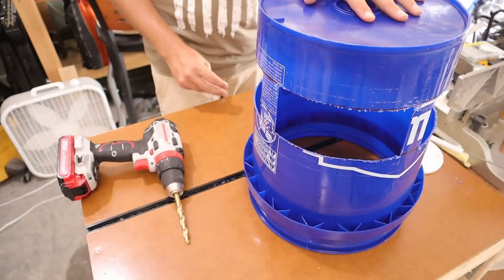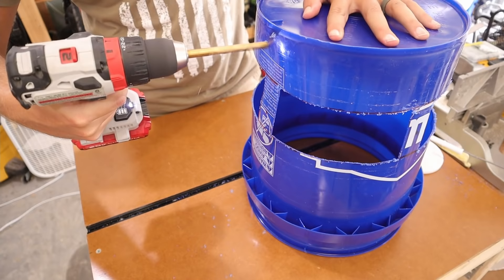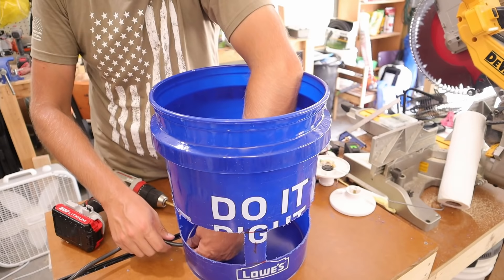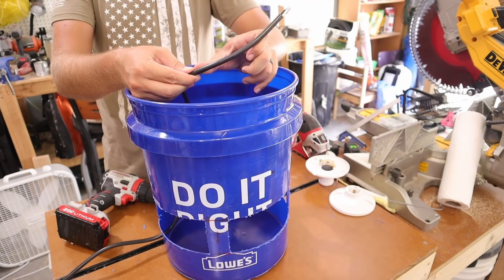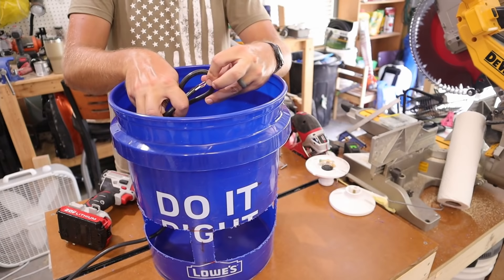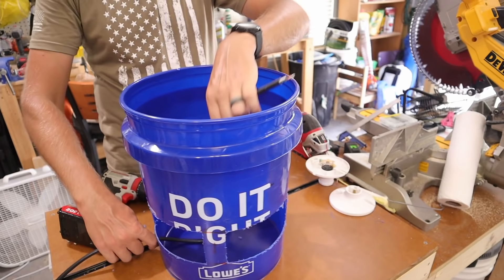The first thing I need to do is run my cord through the bucket — I'll put a hole in the top of the bucket to feed the wiring through into the fixture. Once I've got enough wiring in there for the light fixture, I'll grab it at the edge of the bucket and feed it the rest of the way through. Then I want to put a knot in the wiring so that if anybody yanks on the wire it doesn't pull it out of the light fixture, because if it did and the unit was plugged in you'd have a live wire. With the knot in place, it can't be pulled out of the bucket.